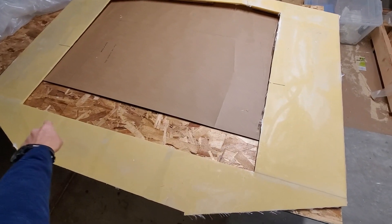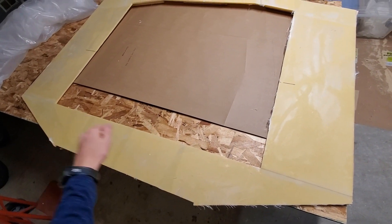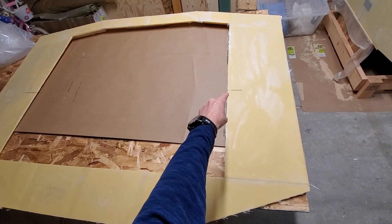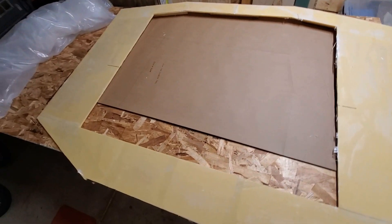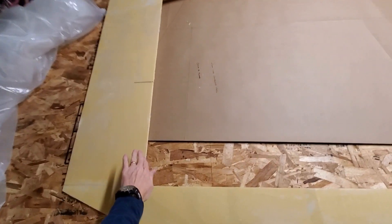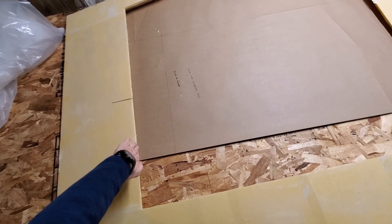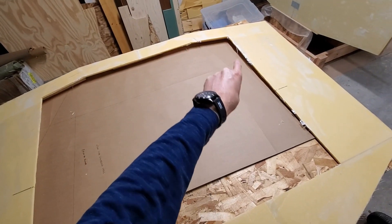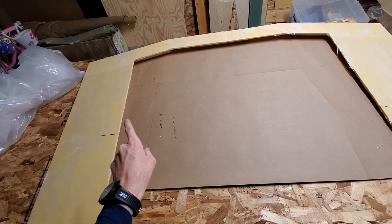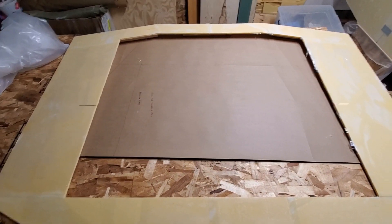The floor will sit on here, so I've got to dig out the core and fill with thickened epoxy and smooth it. From here to here are going to be the walls of the compartments in the boat, so I don't have to do anything there because another piece is going to be epoxied on. But from this line up and around I've got to make it nice and smooth so I can bump my head into it or grab it without hurting myself — and it'll be stronger.